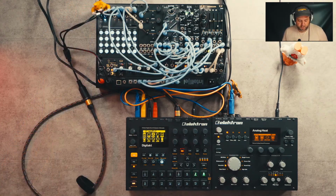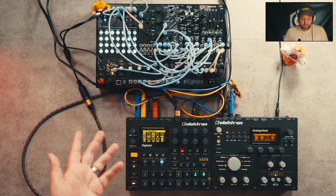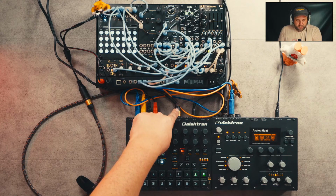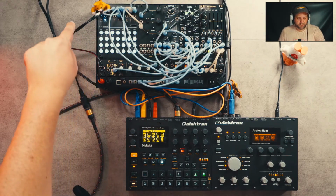And this cable, what it does is it takes a DIN 48 signal and splits it into clock and run individual outputs. So the Digitakt, you can change the functionality of either of the MIDI channels actually, to do DIN 48 or DIN 24. In this case I went for DIN 48. So I have the MIDI through port set up to DIN 48, and then this cable splits the signal out into clock and run, which go into the Maestro.